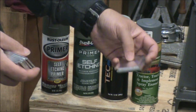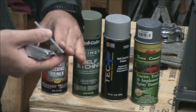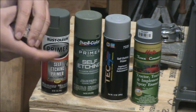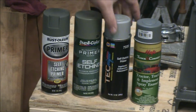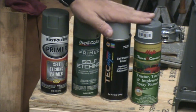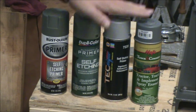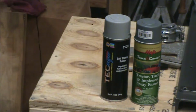And then the other tag is going to get painted and then have a piece of Gorilla Tape adhered to it. And that's going to set for a while, and then I'm going to try to peel the Gorilla Tape off and see how much paint it takes off. Kind of an adhesion test. So basically, first we'll prep the aluminum with the alcohol and then spray each one with the paint and then let it dry for 24 hours. And they're going to be setting side by side, so all the conditions are identical as I can make them. So we'll get started.